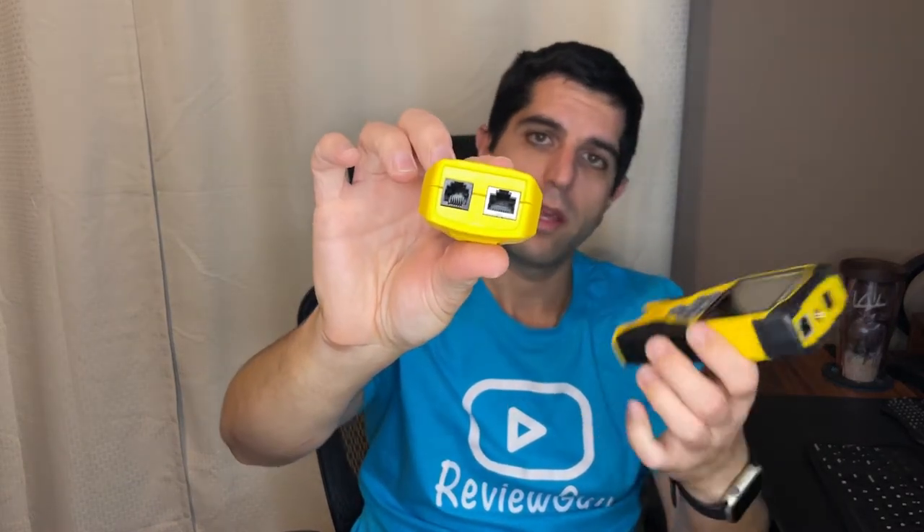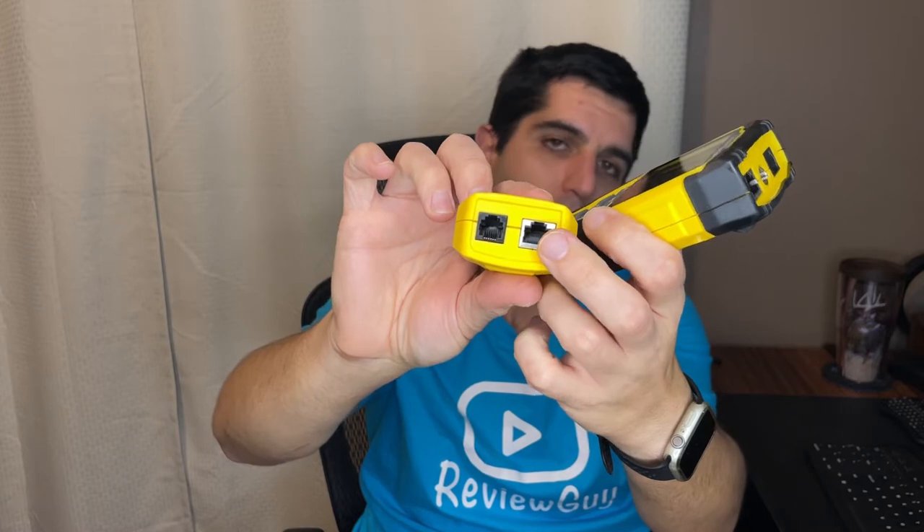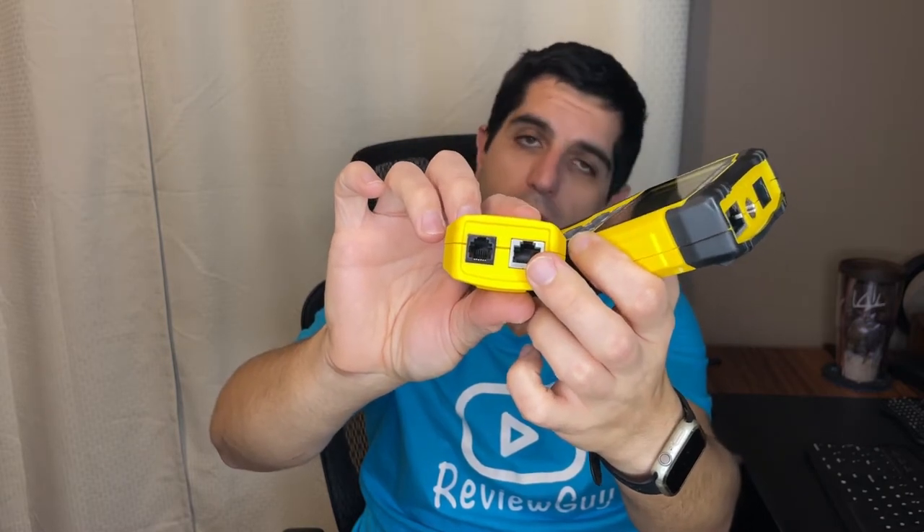The device is very easy to use. One thing I wish I knew is that the remote ID clips will only tell you what room you're connected to — not whether the wiring is okay. On the device itself, there's a little piece on the bottom that lets you connect either an ethernet jack right here, or a phone jack right here — as if anyone uses that nowadays — but this will tell you whether your cable is good.